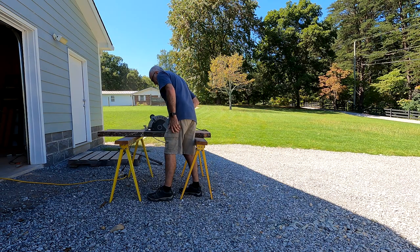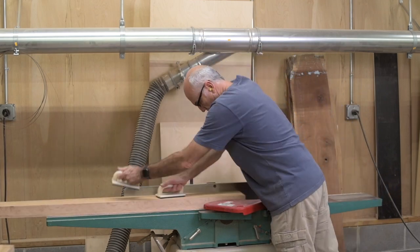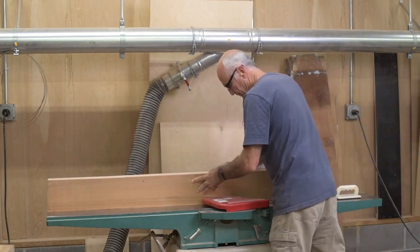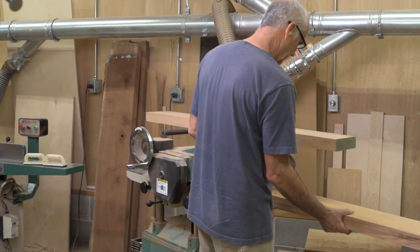So I'm going to double that. I have a slab of red oak over there and it's got quite a bit of cupping to it, so I'm going to drag that out, cut it in half, dimension it, glue it back together like a panel, and then I'll cut it up to the proportions I need tomorrow.